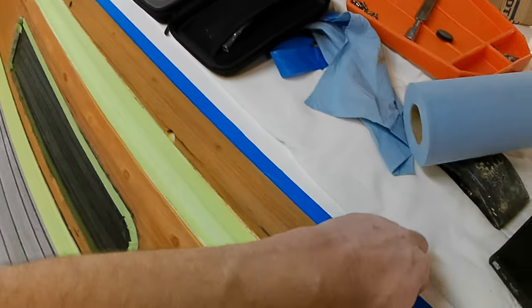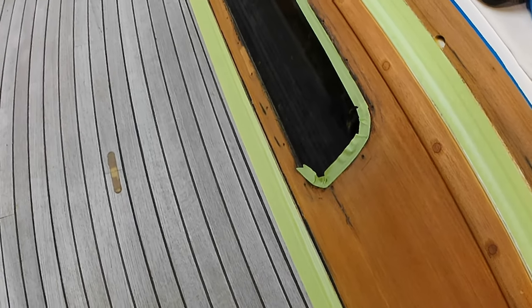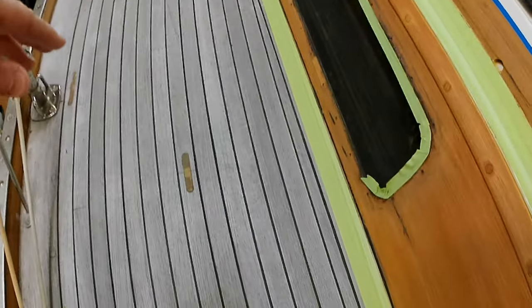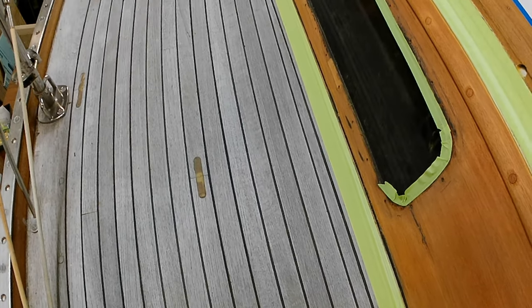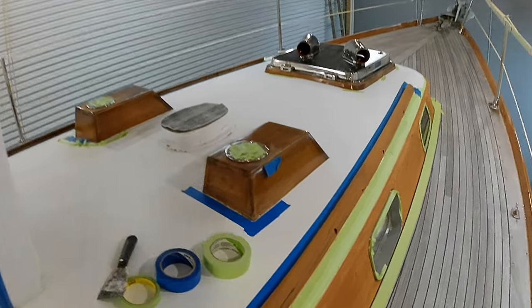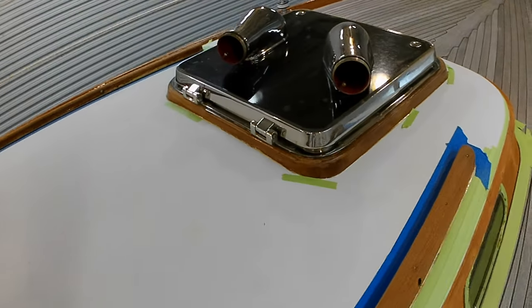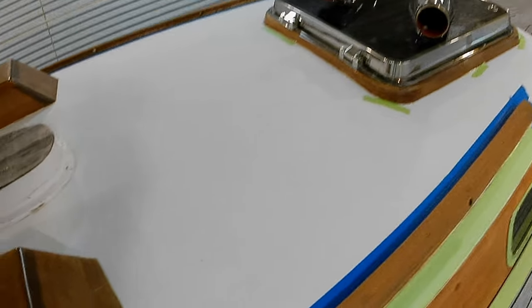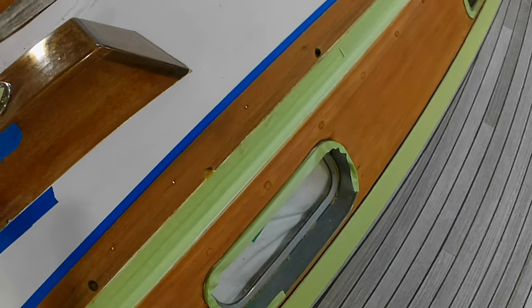I found the cheaper blue tape works just as well on smooth painted fiberglass. I'm going to use the blue tape but use up the green tape first. On the deck I'm using rough-surface tape — it looks the same color as the 233 Plus but it's made for rough surfaces like concrete, and it seems to work well on the rough teak surface. I will get some bleed-under — I always do — but that's just the nature of varnishing on a rough surface. I did tape around the windows and the deck boxes, and I'll touch up with a detail brush.